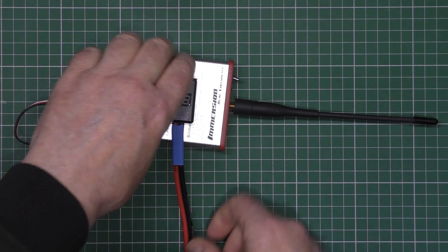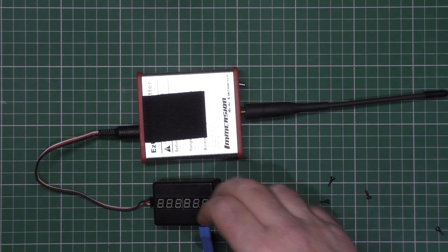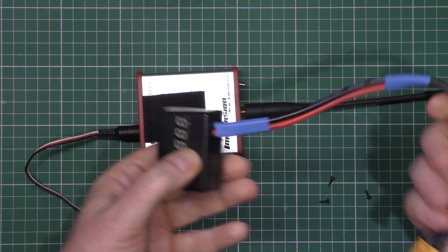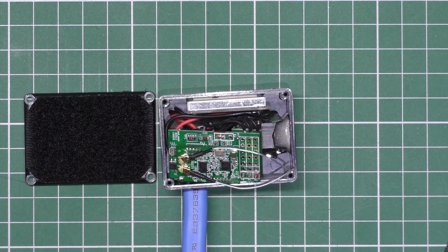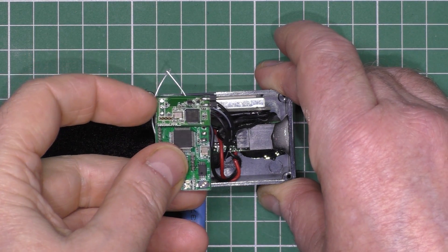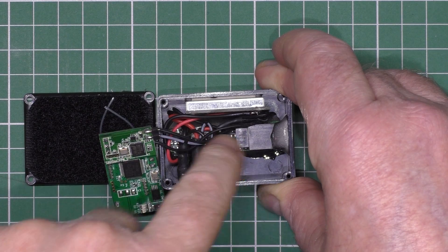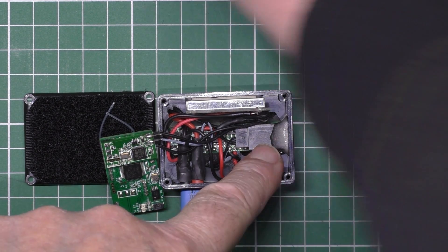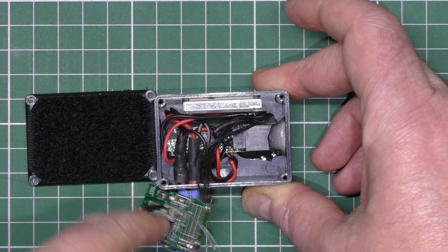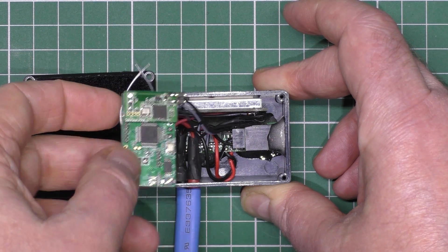So what I'll do is I'll take it apart — it's just held on with Velcro — and I'll show you how to wire it up. It does plug in, so it's completely self-contained. What we have in here is an X6R, piggybacked — I've soldered it directly to the board. This is actually an S-Bus to CPPM converter which goes directly to this plug here. The U-BEC in there is just to power that, and there's also the LED display to show the voltage. That's all.